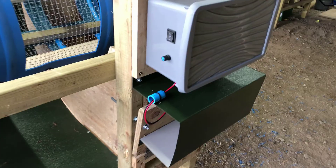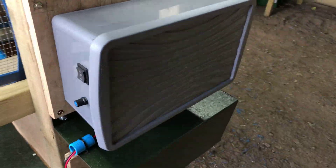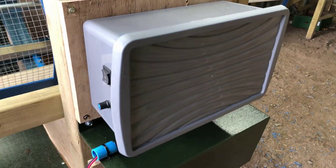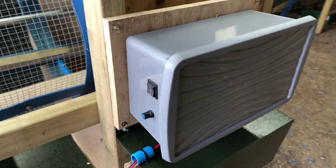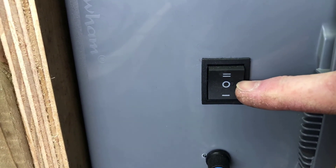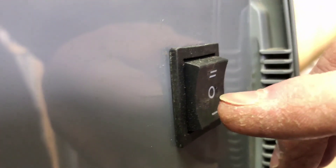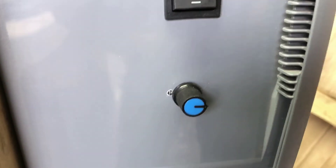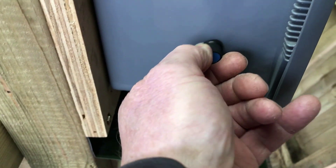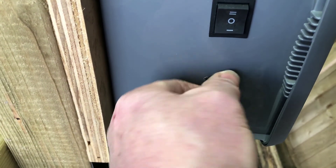On to the electrics. I tried to use a plastic box but it wasn't suitable, so I threw it away and bought this little storage box with a clip-on lid - costs £3.99, perfect. In here is a rocker switch - in the middle it's off, down it'll go one way, up it'll go the other way and reverse it. Then there's a little knob called a potentiometer which adjusts the speed. All the way around to the left it'll be off, all the way to the right you'll get high speed.